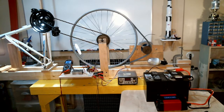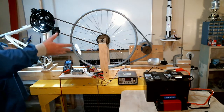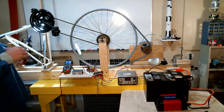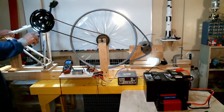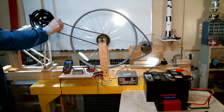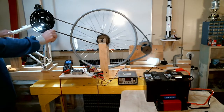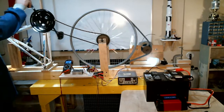Let's spin things up and see how it works. I've got a 12-volt light bulb attached to the system. As I spin the system up, you should see the light bulb on the right-hand side of the screen illuminate. I simply crank on the bicycle pedals — the bicycle wheel starts spinning, which in turn spins the alternator and generates electricity. If I stop rotating, the light bulb goes off. Starting up again, you see the light bulb comes on.